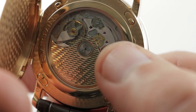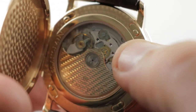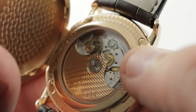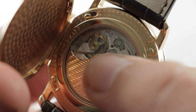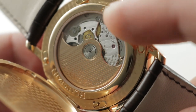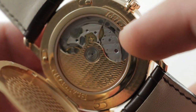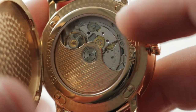As you can see the individual indentations, but you can also see that they are clearly aligned in a wave form. The edge of the rotor as well as the edge of every bridge features a mirror chamfering, and you can see that mirrored anglage — not just on the edges of the bridge, but also within every jewel and screw sink. You can appreciate that there is a Côte de Genève blazing across the bridges of this 28-jewel movement, perfectly aligned and laid down with an abrasive wheel. You can see there is a gradient from one side to the other.